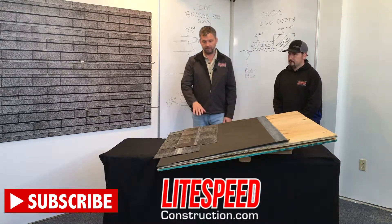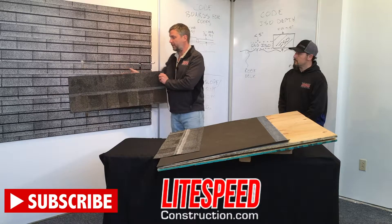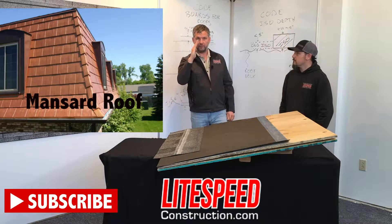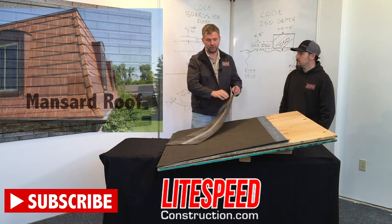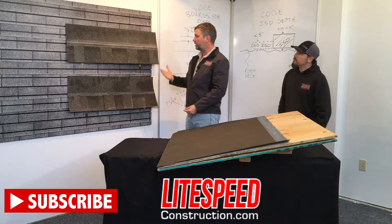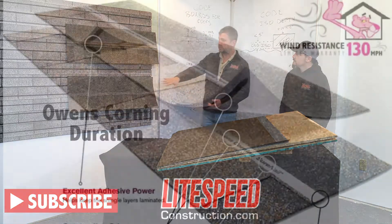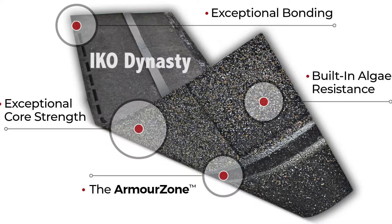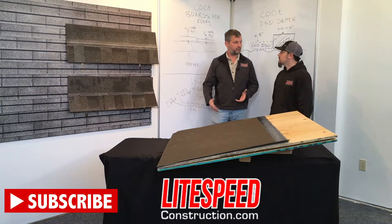The other mention we've got here is that this four-nail shingle — Owens Corning Duration or IKO Dynasty — is also going to work great on a mansard roof. A mansard is pretty much going to be a steep roof that is not usually going to be friendly to your traditional shingles. We see shingles slide all the time. A misplaced nail or the shingle itself is fluid, so it can pull through those nails. That's why we suggest a shingle that can hold four nails and have a canvas reinforced strip, which will make a world of difference in keeping that shingle from sliding.